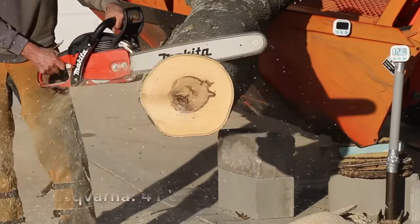The carbide chain did do a lot better, but there's still quite a bit of damage to the chain. Now let's see how long it takes to cut through a single 4x4. The new chains only needed around 10 to 15 seconds to cut through 12 4x4s — about one second per 4x4. The Upstart now needed 16.1 seconds, which is longer than it took to cut through 12 4x4s when new. The Sungator needed 13.32 seconds — still pretty bad but faster than the Upstart. The Forrester carbide needed 4.78 seconds, the fastest of all the chains after sand, but still more than twice as long as the new chain. The Forrester carbide did by far the best, Forrester full chisel 2nd, Zentop 3rd, A10 4th, and Sungator 5th. However, none of the chains are sharp enough to provide good service after the sand exposure.